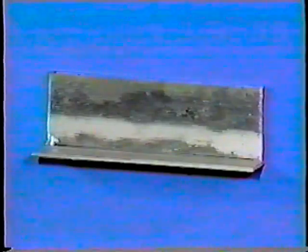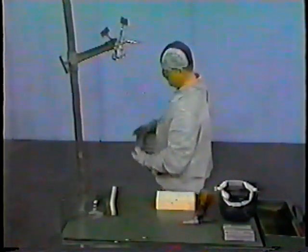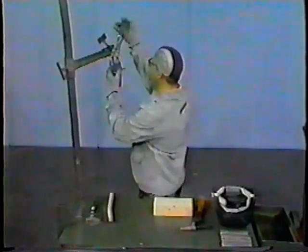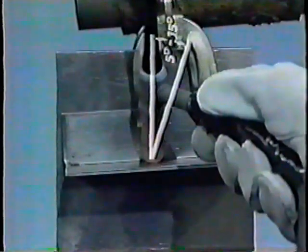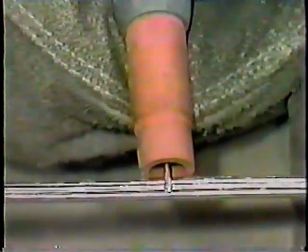Here is a properly tacked T-joint, cleaned and ready to weld. Place the tacked coupons and backing plate into the welding jig at chest level or higher with the T-joint in the horizontal position. Make sure the vise grips are tightened over the workpiece to keep the metal from falling out. The jig is being tightened for safety purposes to ensure that the jig itself does not fall down during the welding process. When TIG welding in the horizontal position, the torch is held at a 45-degree angle to the workpiece and tilted 5 to 15 degrees with the tip pointed in the direction of travel. Here is what the combined angle looks like. Before you begin to weld, the tungsten electrode is extended beyond the ceramic cup one quarter of an inch, or two widths of the filler rod, for all T-joints.